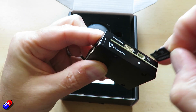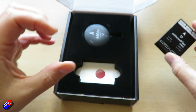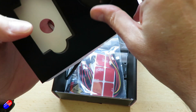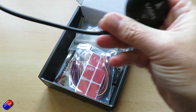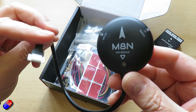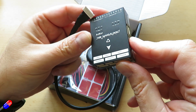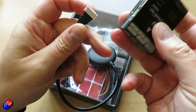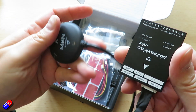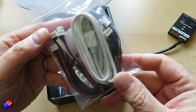They've also included the PWM pins as part of the unit, so rather than having separate auxiliary PWM pin connections like the 6C, the 6C Mini puts it all in there. With just this unit and the GPS you can get all of that ArduPilot goodness whether it's a boat, car, quad, plane, or wing. It's vibration isolated to reduce noise and help with IMU situations where there's a lot of vibration. The IMUs are also temperature controlled with onboard heating resistors, meaning they don't drift as a function of temperature as the unit warms up.